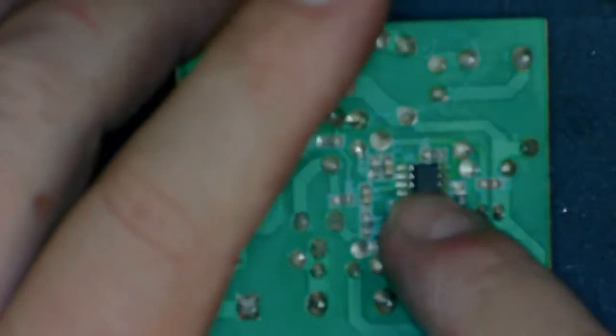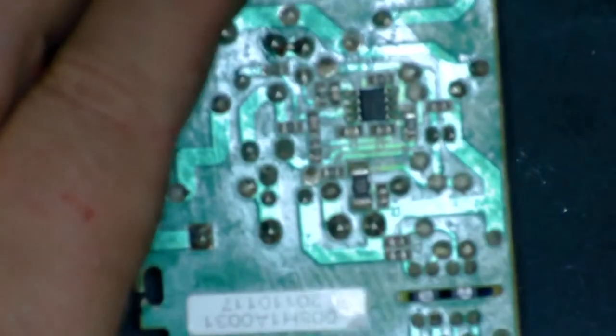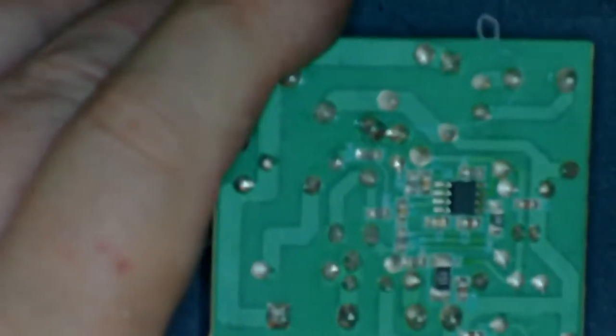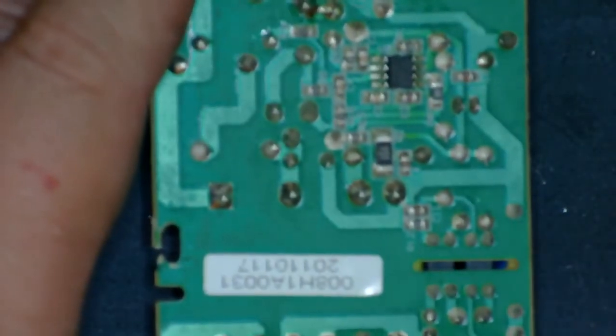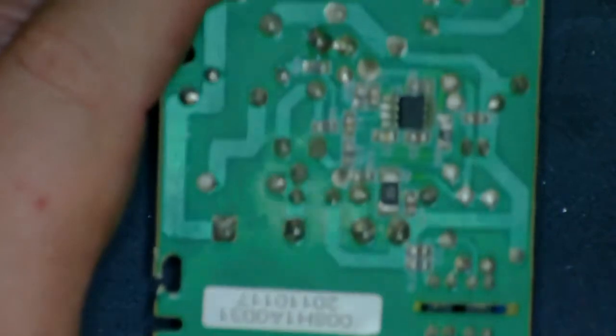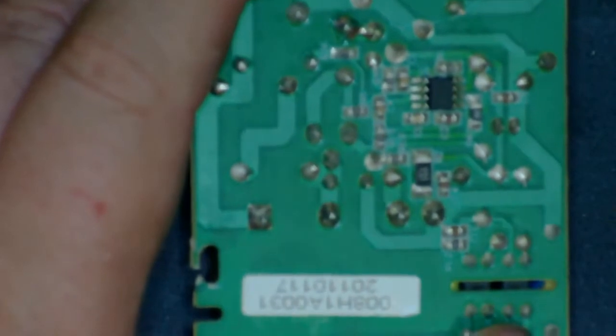With the exception of this, we've got a surface mount IC on the back side. I don't know if we can zoom in more, but no, we can't with our current camera setup. We'll have to get a microscope going. But you can see where they've separated the high voltage and low voltage side. Mostly when you see slots in the board, it's for creepage and clearance, trying to prevent the voltage from carbonizing a path through the dielectric and creating a short circuit situation. Interesting, interesting.